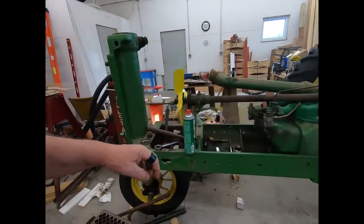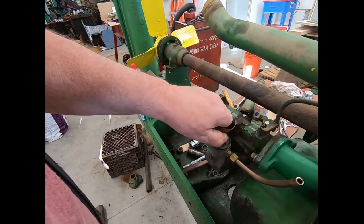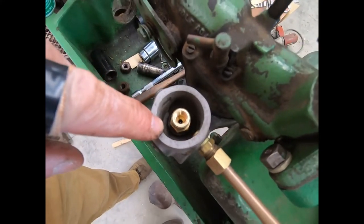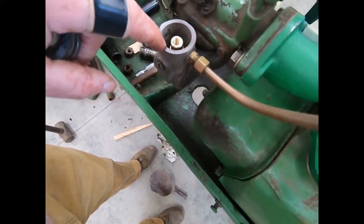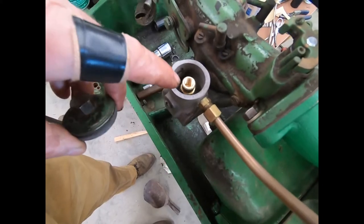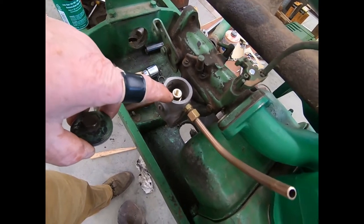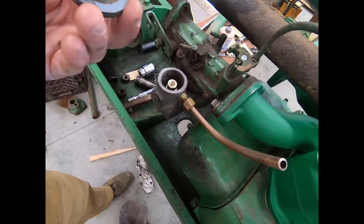Also, I wanted to tell you, this carburetor, of course, it runs the balls, but I've got one problem with it. You notice there's no fuel at all in that bowl around the outside. Even if not full, it should have some in it. So that's leaking around that gasket. Now, if you remember right, on the carburetor rebuild, that seat area right here was quite rough.